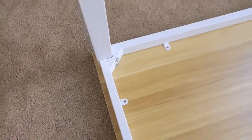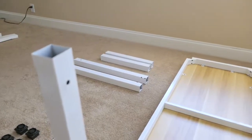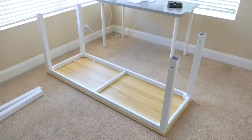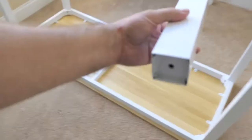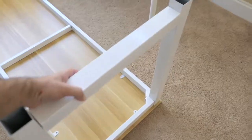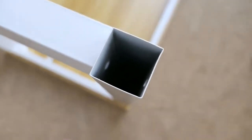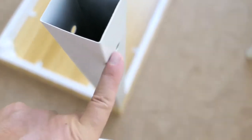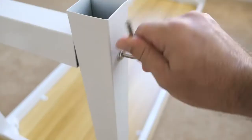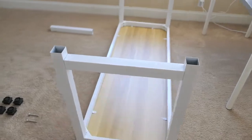We got those two bolts tight. Let's grab the other leg and put it here the same way — the hole needs to be facing the other leg so we can put the brace in between. We got the four legs on, nice and tight on each corner. Now we just have to do the braces — they simply go in between the legs, and there's a bolt on each side. Note that the leg is hollow, so when tightening this bolt don't do it too tight or you'll crease the end. Make it barely snug, and if you feel it starting to cave, stop. Put the feet in and insert them into the leg.